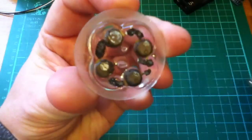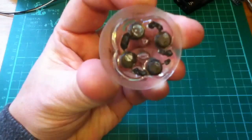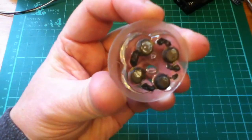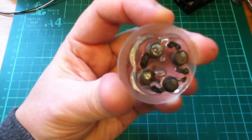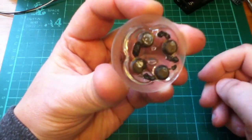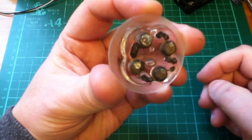What's happened is the LEDs have melted themselves into the lens at the front, and the PCB tracks have actually come away off the PCB and are attached. The solder didn't melt, but the tracks came off the board.